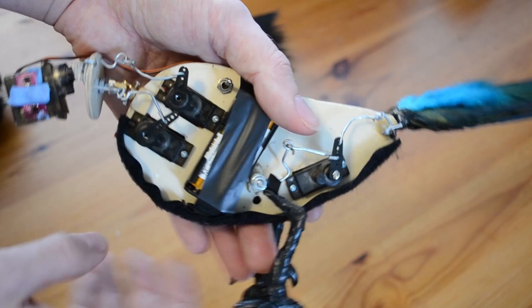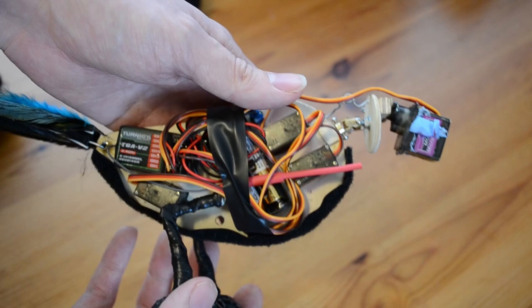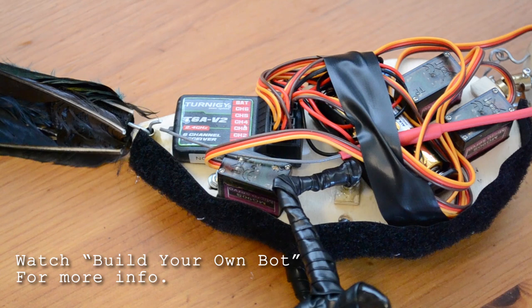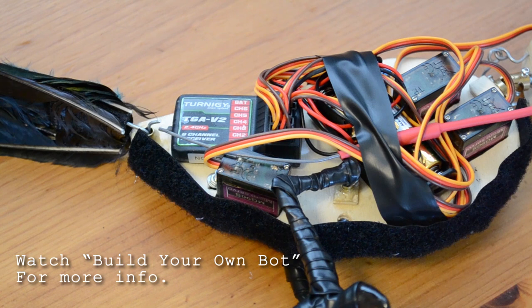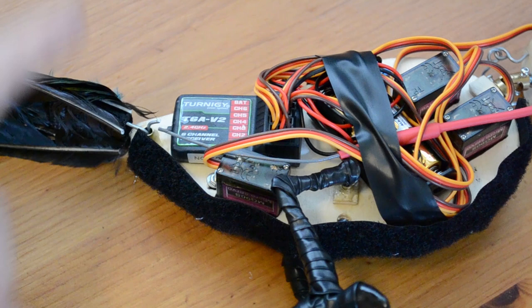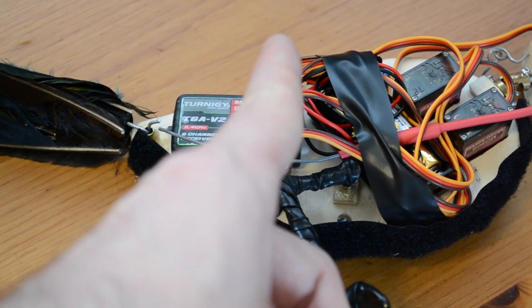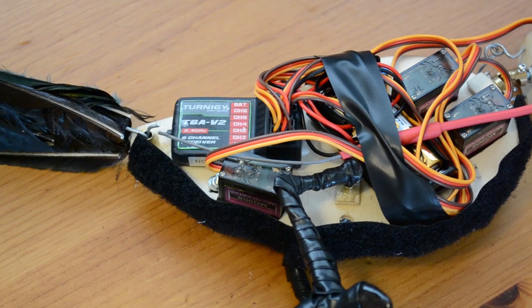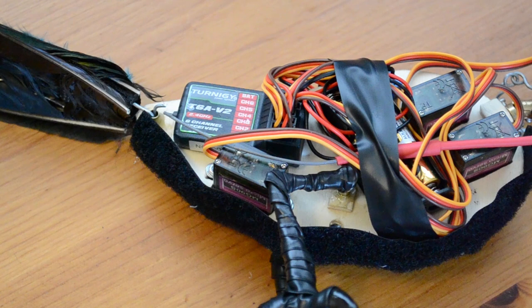Got the tail there. And then the other side — apart from the battery which is held on a little bit of tape — this horrifying amalgamation of gubbins is actually deceptively simple. That is a remote control receiver — the remote control receiver just has a whole bunch of channels and then you stab your things in. The circuit I was building earlier was just a test whilst I didn't have a remote control system. These remote control systems, because they're made for model aircraft, can only move the servo about 45 degrees either side of 90, so not a huge amount of movement, and you can't control smoothness or change the sticks. You could break it open and hack it, but it's a lot easier to make an Arduino-based control system. However, for the amount of movement I needed, it does enough and it's much easier to buy something off the shelf and plug it all in than to completely make your own.